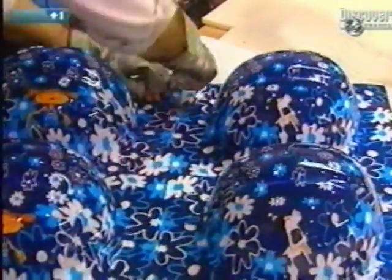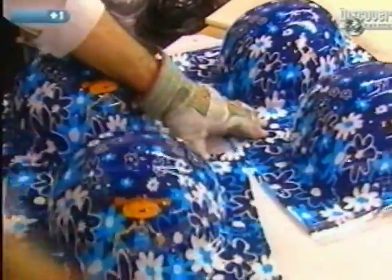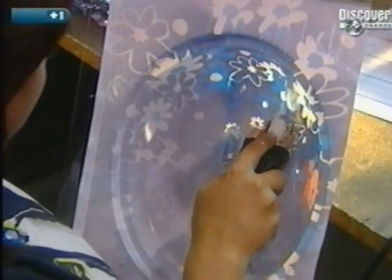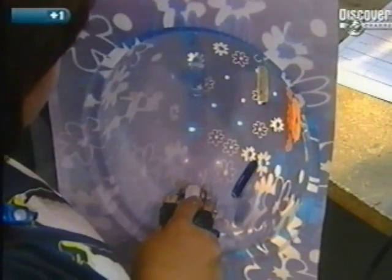Then when cooled down and hardened, the four shells are cut by hand. Ventilation openings are cut with a heated wire. These openings have been preformed during moulding of the shell. The heated wire easily and neatly cuts the polymer.